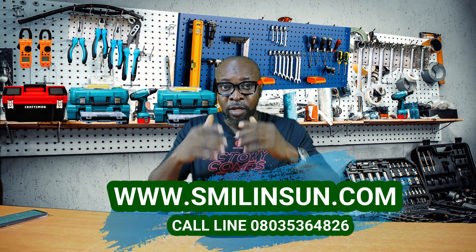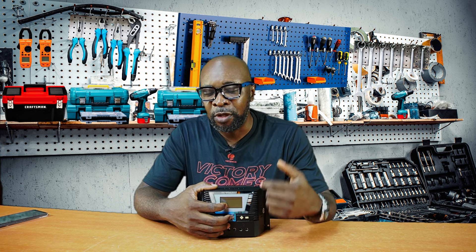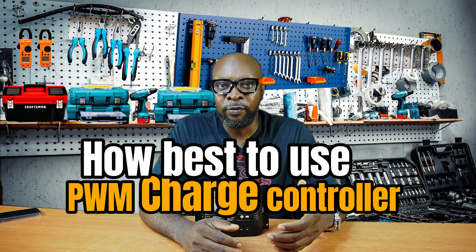You just need to know exactly how to use the PWM. If your system is a 24-volt system, you can still use the PWM and get optimal performance. For a 24-volt system, use a 200-watt solar panel. The VMP of a 200-watt panel is around 28 volts and the VOC around 36 volts, which is quite close to your 24-volt system. So: 12-volt system goes with 100-watt panels; 24-volt system goes with 200-watt panels. The PWM can also handle a 48-volt system.